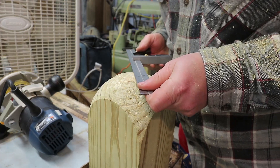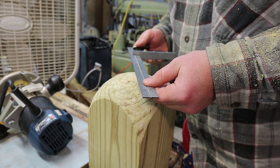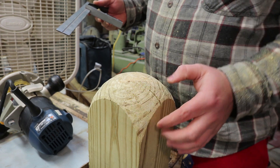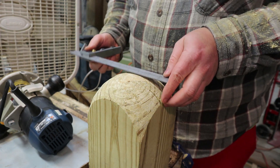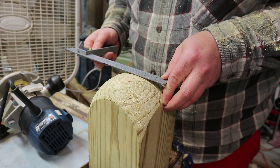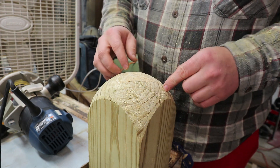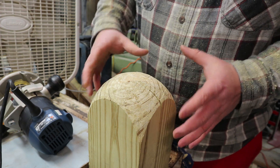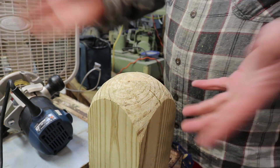This sphere has a diameter that's approximately the diagonal of this 5.5 by 5.5 log or post, which is 7.75 inches. So this is about a 7.75-inch sphere diameter, except around the edges. If I had extended the bit out further so I was cutting a radius of 5.5 or less, then you would be working towards a true sphere — in which case it would be better to cut this off and work at it from all angles. You'd have to worry about a fixturing method to make sure it's clampable from any direction. But yeah, it works.